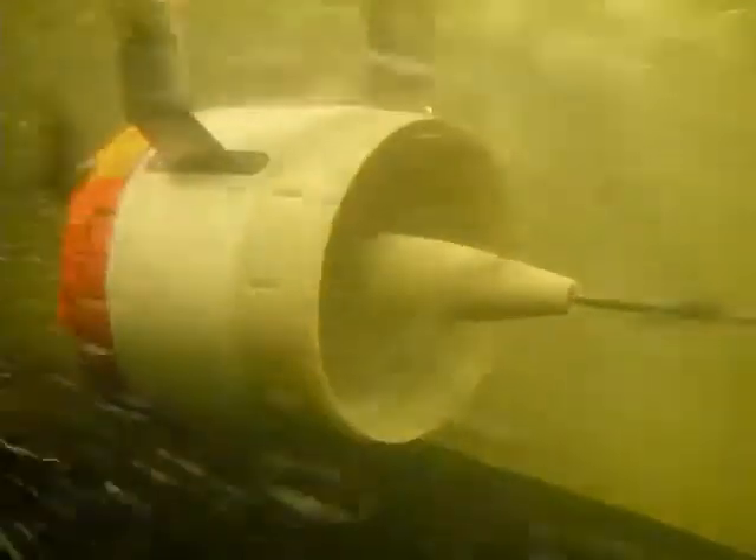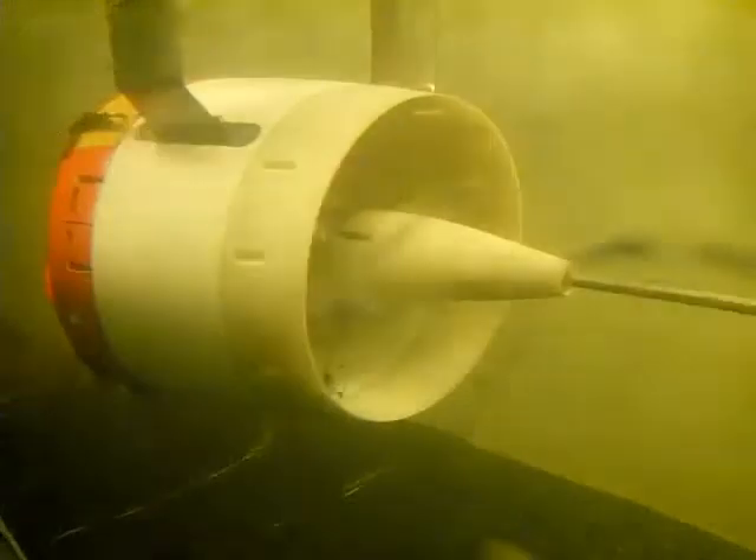At the moment we have a very small turbine in there because it costs a lot to model at large scale. We're currently generating about 500 watts, which is enough to power half a kettle. The power output scales with the proportion of the area — our run-of-river turbines are looking to produce around five kilowatts, and our tidal turbines, which are a bigger commercial scale, around about a megawatt of power.